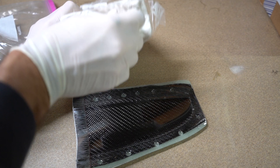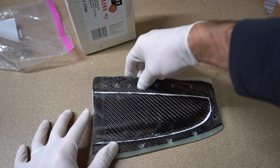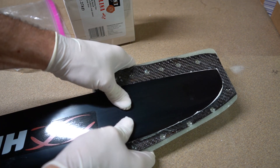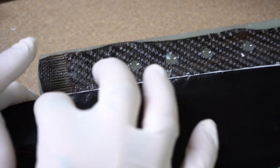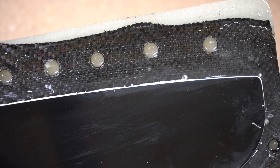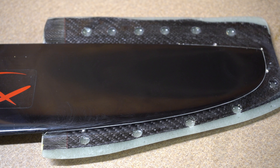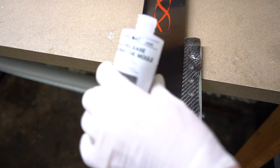Now it's time for the clay. This was the first time I've ever used clay in any of my mold making — and let me tell you, it makes a difference. Boy, this one did come out nice; that's why I chose it for the video. This prevents the next layers from going down underneath the plug — which is the propeller; you call it the plug during a mold making session. You're sealing up the cracks so the epoxy cannot go down underneath the propeller. That gives it a good parting line — very important. This tool here makes a nice radius. Once you get the clay how you like it, you want to give it five to seven coats of wax, let it haze off, then buff it until you have a nice shiny plug.